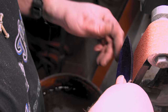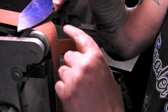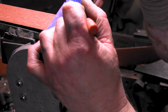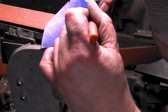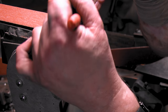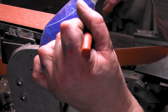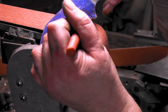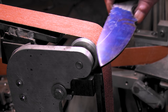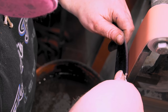Yeah, 45, well, it doesn't have to be 45 degrees. You just want it at an angle, and then you're going to come down to your line on both sides. And here's what I was going to say before I realized I didn't have a notch: stay in front of your notch. Even though after heat treat you're probably going to want to come back here, wherever you want to stop, I would stop ahead of your line. So here's where our plunge line is going to be. Until after heat treat, stop right here. You don't have to, but I still do it. I've been making knives for 5 years and it just seems better. All right, enough rambling, let's get to it.